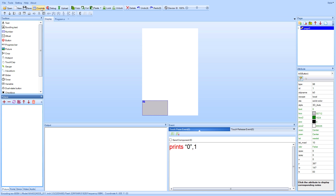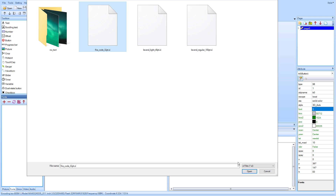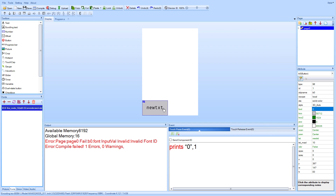When I press the compile button you will see an error because our button is using font number zero but we don't have any fonts in our project. You can generate a font by going to Tools > Font Generator. I'll cheat a little and add a font from an older project — it's just a placeholder font because I don't really want to show anything on the button. I want the txt property to be an empty string, because later I want all the buttons made from images.